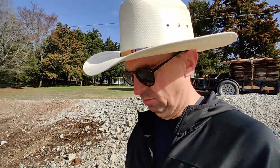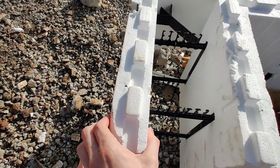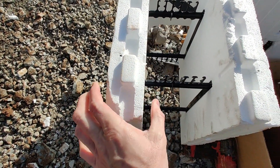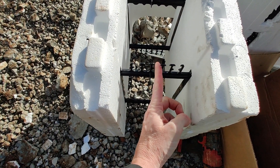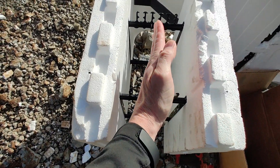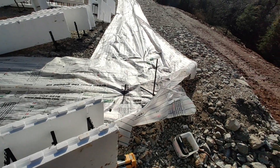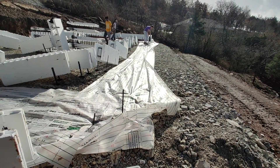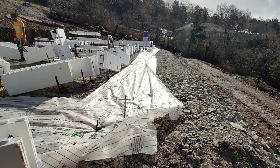What we're going to be working on today is what is called ICF — an insulated concrete form. Two inches of insulation on this side, two inches of insulation on this side, and the rebar will sit in the middle with the concrete. It's a horizontal and a vertical run. This is going to be an integrated footer and wall at the same time.